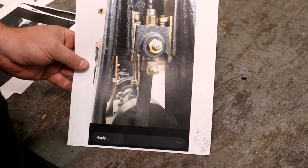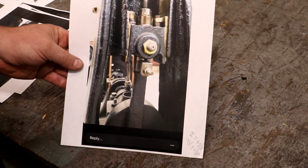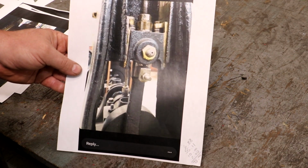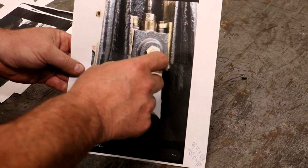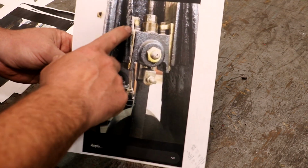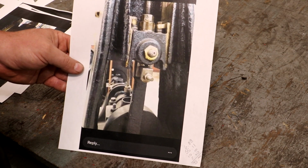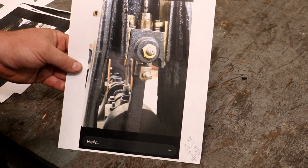And you have these little brass shoes on either side. They're kind of a wedge-shaped shoe. There's a little tab on the top where you can put a bolt in there and adjust them. The reason they have the taper in there is that it's adjustable. As the brass wears in these shoes, you can just tighten that up. That moves it down. When it does, you have the wedges going against one another, and it widens it out. So you can adjust this on the fly as wear happens, and just keep your engine up and running in good shape.